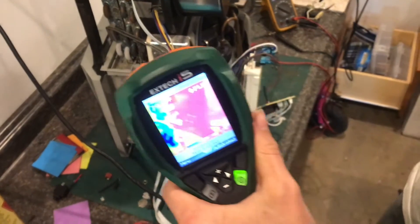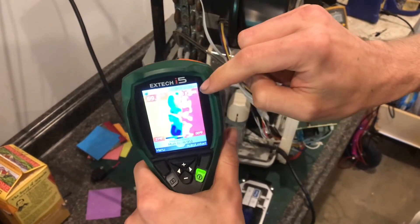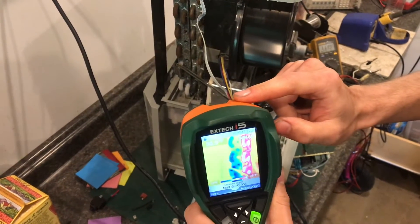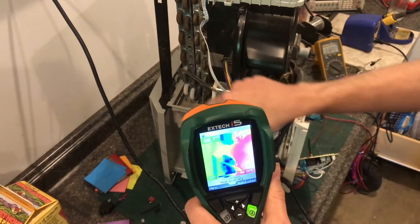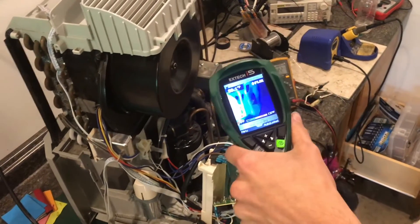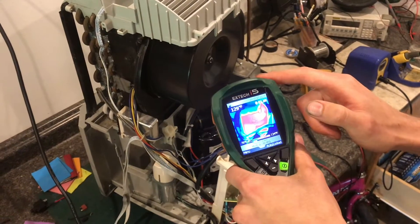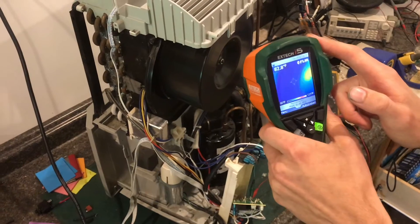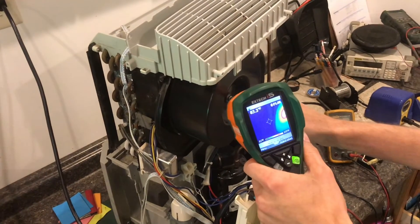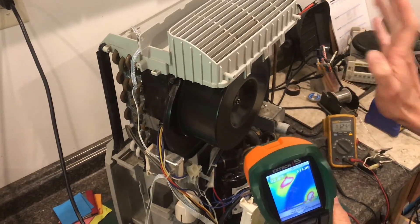I'm using this infrared thermal camera to verify the system. You're seeing this chain of red — those are these copper loops and they're at 80 degrees — and right beside them, these loops are cold at around 50 degrees. There you see the temperature difference created by the compressor. You can also look at the compressor, which is that huge red mass, and see the temperature climbing. The fan is also pretty warm. If you run this motor without the squirrel cage assembly, the motor will get hot because it was designed to run with a fan cooling it.